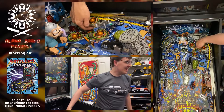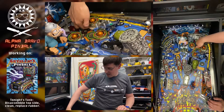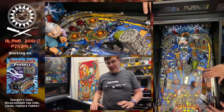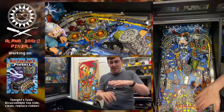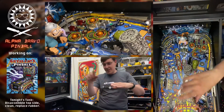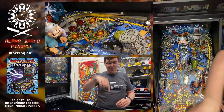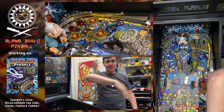Underneath here you've got these little white discs. It's basically a round flat white disc and the ball can roll over it from any side and cause it to tilt. That disc is not just a disc — on the bottom side is a stem. The stem is pointed straight down towards the underside of the playfield, perpendicular. If the disc is tilted in any direction — 360 degrees — the stem will move alongside the disc because it's all one piece. The stem goes underneath the playfield and is deflected like an arm.